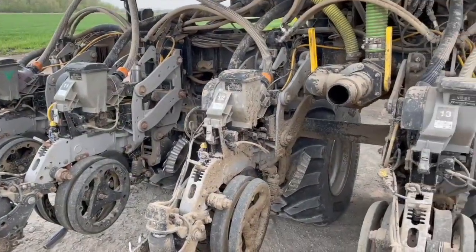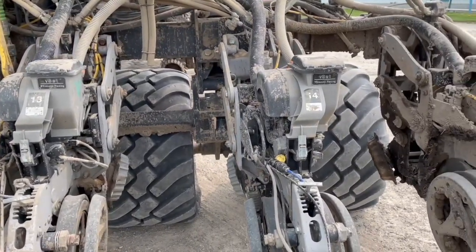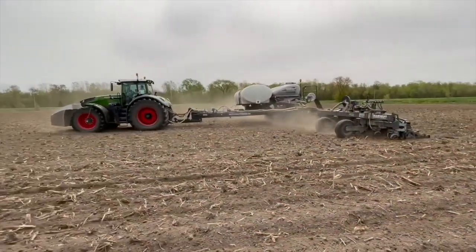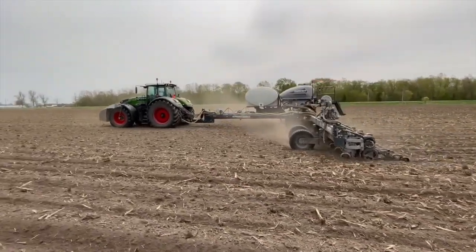Can you talk about the differences between these large radial tires with the air system and tracks? Tracks are great in the field, but if you want to run loaded on the road, a tire inflation system is by far superior — you can push the PSI up and just run down the road like normal. On the Harvest International frame, the tires lift in front of the row units rather than between, and that's what allows you to go with a 24-inch wide tire.